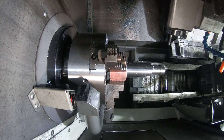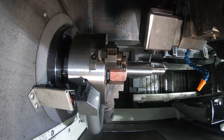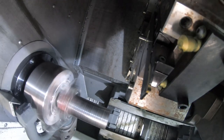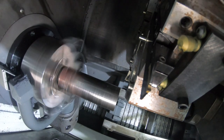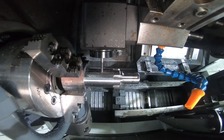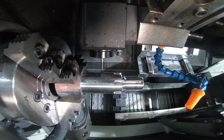We can do all that from the C axis of the lathe and the Y axis and X axis of the lathe. So it'll go get heat treated and it'll come back and we'll hard turn it — we have to hold a tolerance of about plus or minus two tenths. And the ST-15Y holds it well. The part comes off perfect every time.